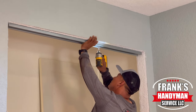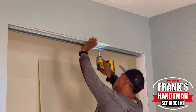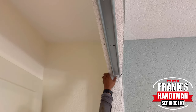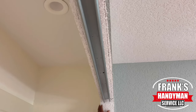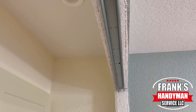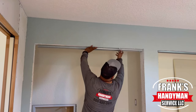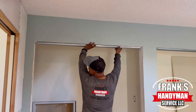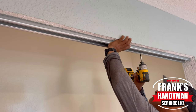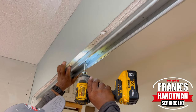The nice thing about this metal railing is that it has several holes throughout the entire length. You can put screws in every single hole if you want, or you can just put one screw kind of diagonally throughout the entire length, which is kind of what we're doing here. We noticed that helped to secure it really strong to the top plate.